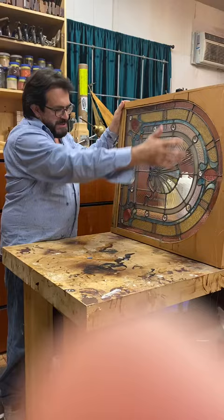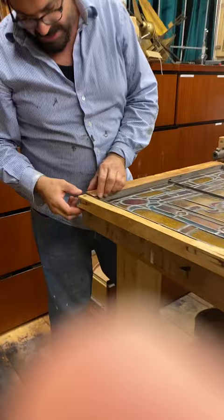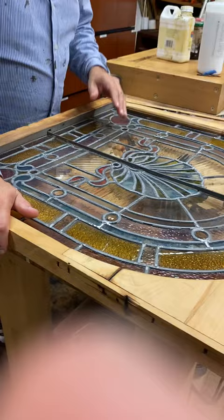So they've taken it somewhere 20-30 years ago and had this terrible frame put around it — looks like it's from a door. You can see some of the mortise and tenons coming through the side. They took door stock, cut it down, and just literally jury-rigged something together, just horrifically — some pegs and nothing's flush. Just terrible. You can see the flex in this window, and part and parcel is this frame that's not really stable.